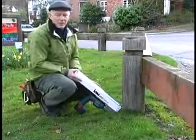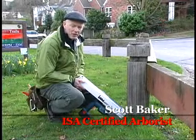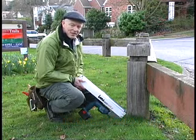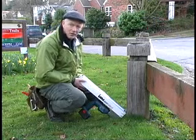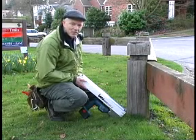Another important use of the resistograph drill is evaluation of structural timbers. There are many places where decay can weaken timbers such as this one, and the resistograph offers a quick way to test and see whether you have a structure that's still safe. We're going to test in the typical below-grade angle of 45 degrees, which gives us a reading down into the area where decay is most likely.